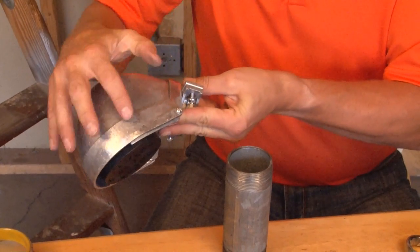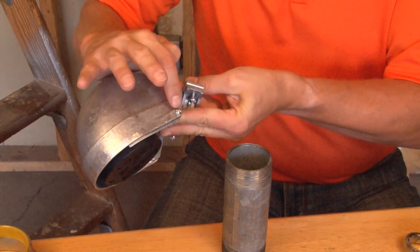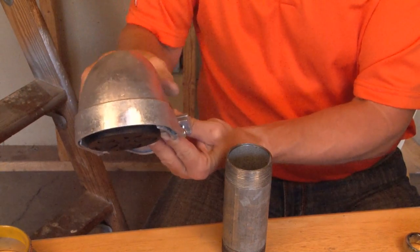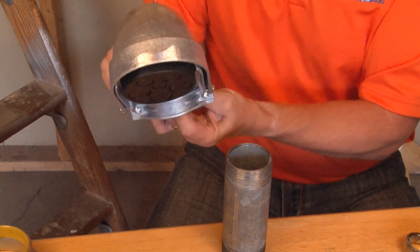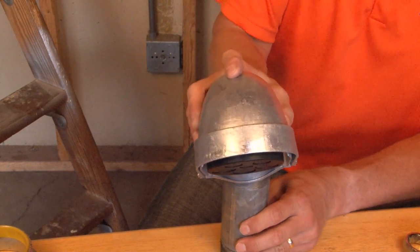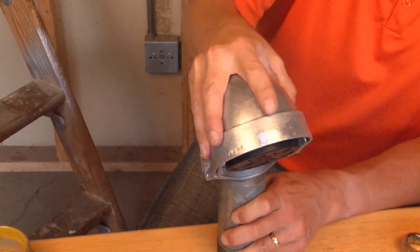On each side of the shroud and the head there are set screws that easily remove and allow wire pull through the top once this is clamped on the pipe. To install it, you simply align it with the top of the rigid conduit and slide it on until it seats in place.